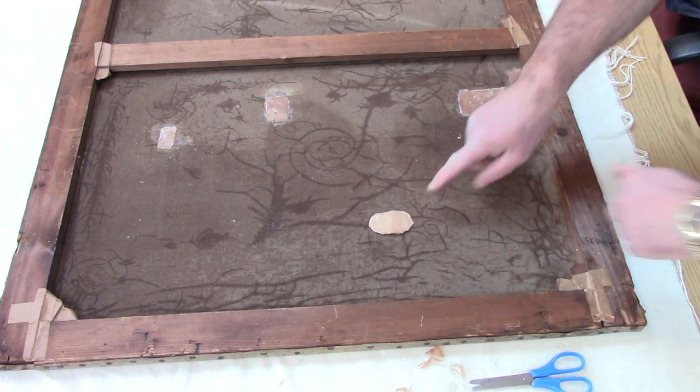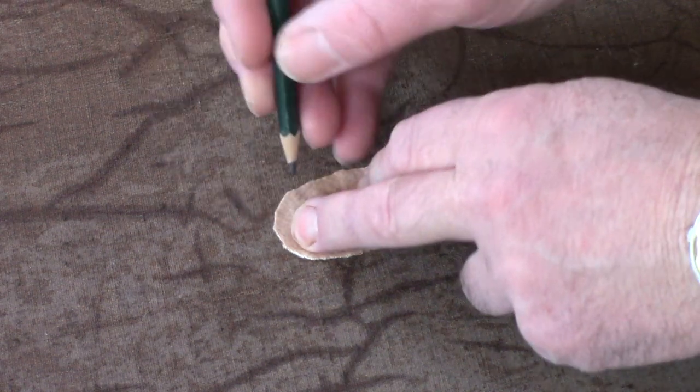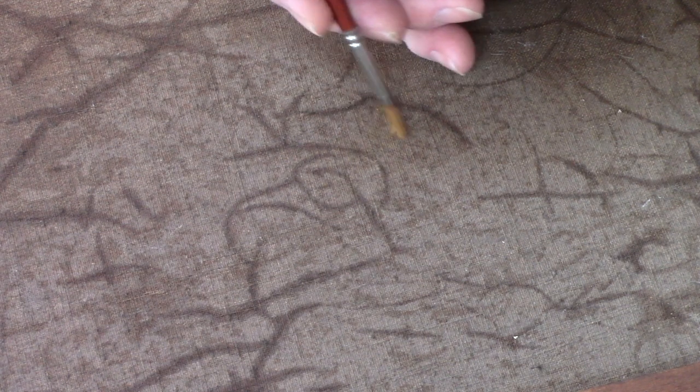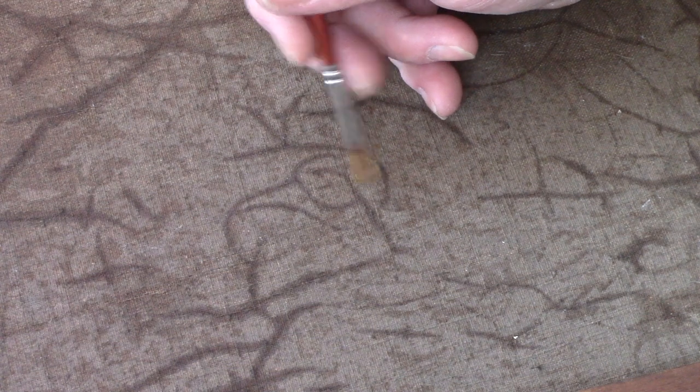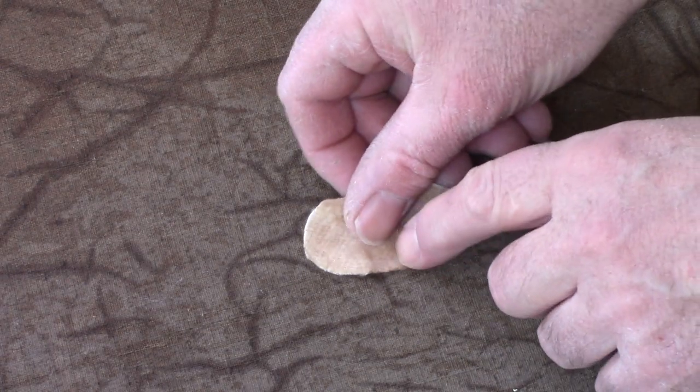I'll show you what we do with it — we pretend that that's got wax on it. Take your patch, put it on where it's going to go, and make marks around it just so you can remember where it's going to go. Then brush on some wax to prime it, but don't go right up to the edges of the patch — keep within two or three millimetres, because it will all ooze out when you iron it. So that's primed up. Now put our patch on to where we've already primed.